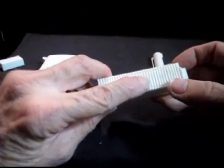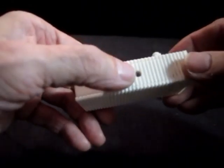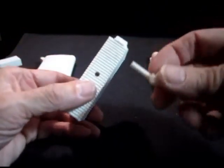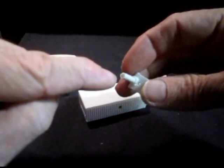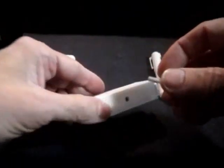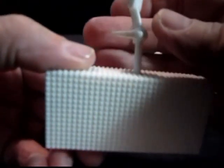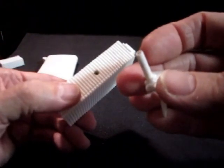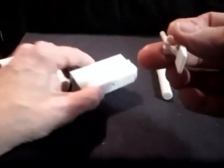We have the hole here, and that's where the cuff link goes in, and I made some changes there as well. I don't know if you can see in the video, there's the head of a threaded screw right there. So I cut the head off and put a slot in it, and so now the cuff link can be threaded in this way, so the threads are running down through this tube. So instead of having threaded pieces visible on the outside, the threads are now on the inside of the tube, and this will fit around the head of the end of the screw here, and of course it just threads in like that. So that was a change. I wanted to make it not so obvious what this did. I didn't want any threads on there, and of course when this is painted gold, the head of that will be gold as well, and it'd be less visible. So that was a change.